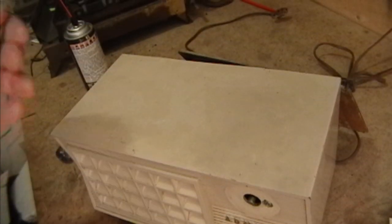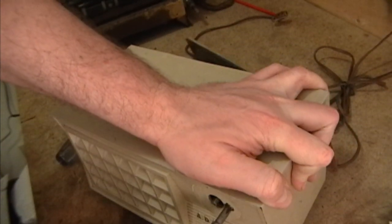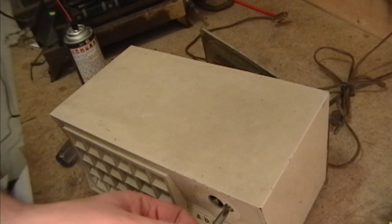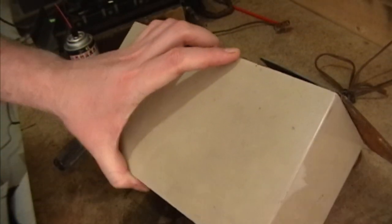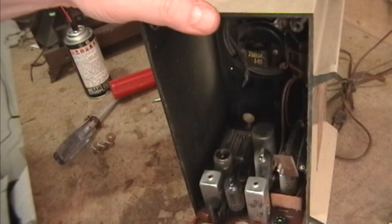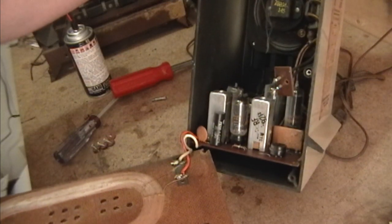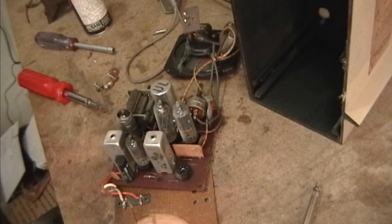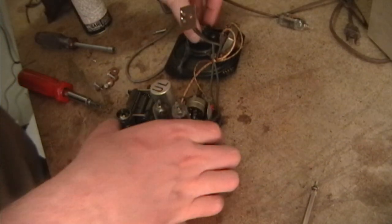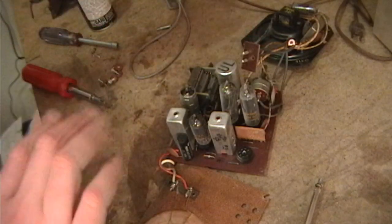That's a Phillips screw - I bet that's what's holding this thing in. I will give this cabinet a good cleaning. Now, looks like the speaker is hardwired in so I can't just unplug it - I'll have to take that out as well. I just had to take out two screws holding the speaker in place and I was able to extricate the whole thing. Before I damage any of this stuff I'm going to unsolder the antenna and the speaker and set those aside, then focus on this little circuit board.